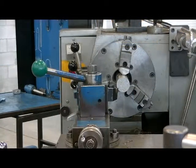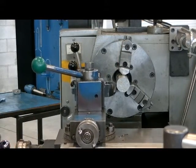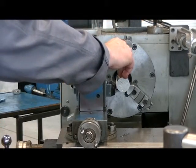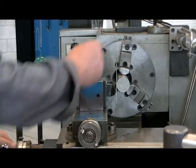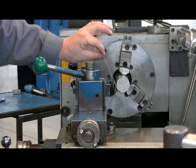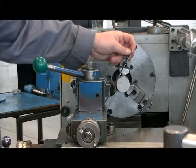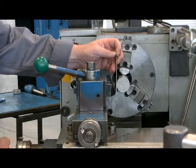We can also check if the tool is on center height using an old pocket ruler. To do this, we're going to move the tool and bring it gently in against the diameter of the workpiece. Place the ruler between the workpiece and the tool and slowly move it in until it snugs up. If the ruler is vertical, then your tool is on center height. However, if the ruler is leaning towards you above the part, then the tool is below center height. And if the top of the ruler is leaning away from you, then the tip of the tool is above center height and can be adjusted accordingly.